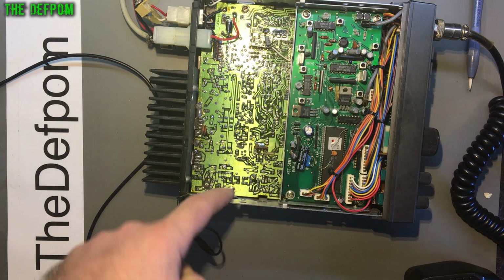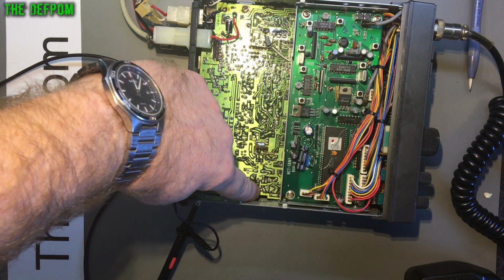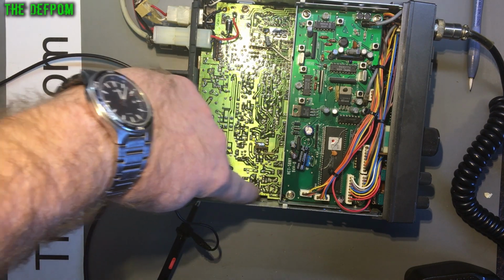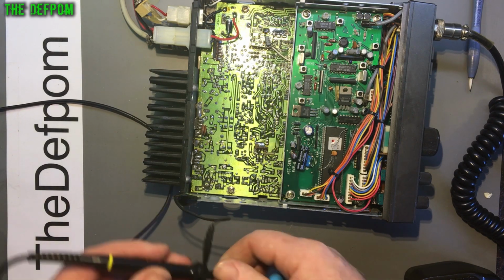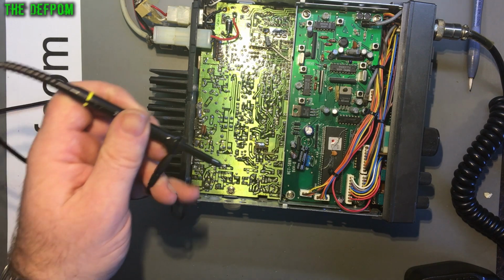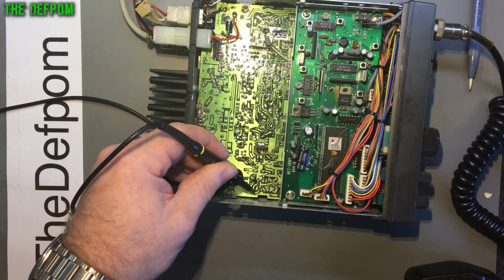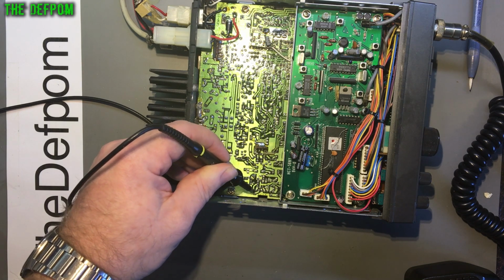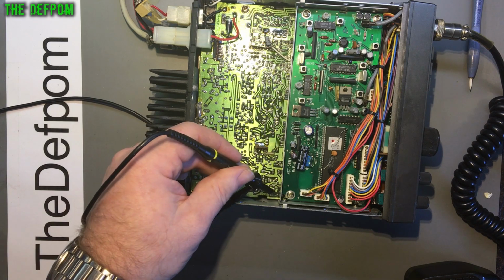On the TX mixer, which is just here, you can see there are 6 pins along there. Well, sorry, what was it, 8 pins? Is it 2, 4, 6, 8, 9 pins. Right, TX mixer's right there. Now, pin 6 should be the 38 megahertz when you're at 28 megahertz on the display. It should be 38.695 or something from the VCO MPU board, which is that pin right there. It goes in to that pin there, which is from this jumper which runs up here.